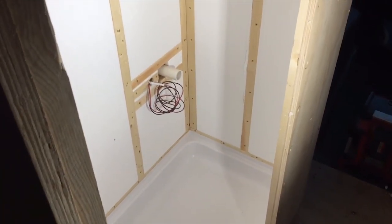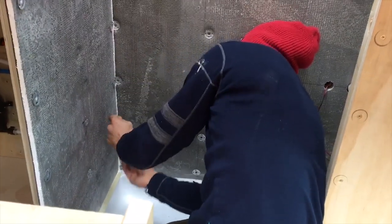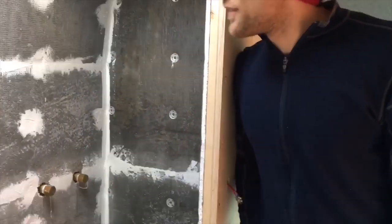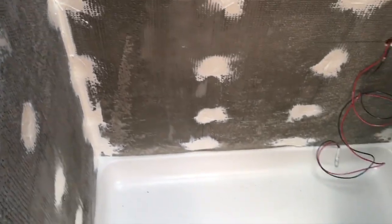All done with the framing and the polystyrene insulation. Next stage is to put on the backerboard. Callan is installing the backerboards in the shower — the shower tray is already in, and once we get the backerboards on we can start waterproofing. We've almost finished — the foam backerboard is on and I've put polyurethane sealant everywhere I can, covering all the screws and washers. Now that we've got the backerboards on and our seam tape on, we're ready for the waterproofing membrane — I'm going to paint that on, let it sit for about an hour, then do a second coat. That'll be the first layer before we put the mortar on to actually lay our tile.